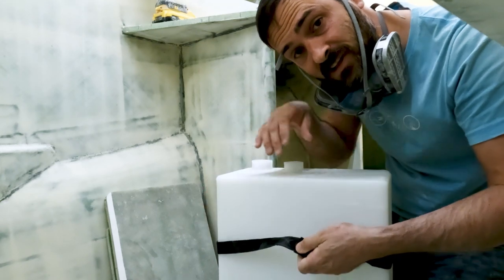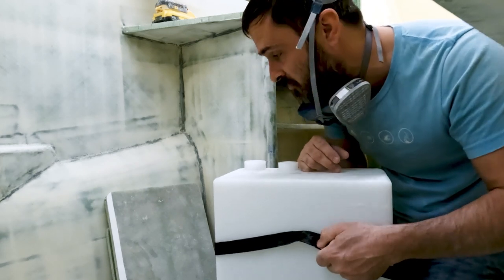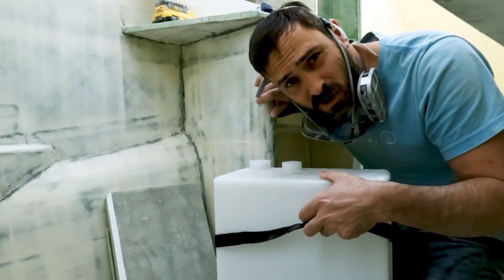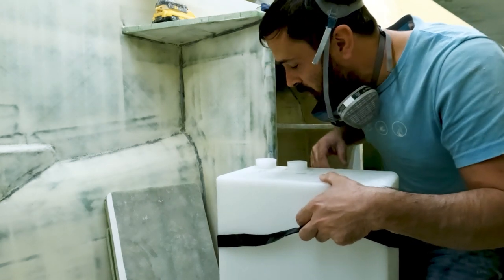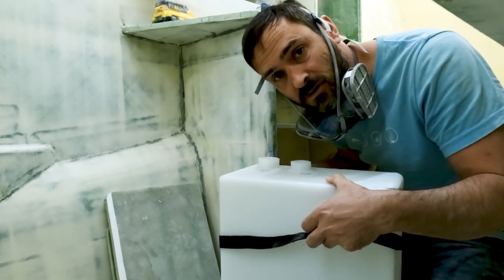Have two of these. The idea is that these will actually be glassed, fiberglassed in, because keep in mind this is all foam core composite construction. There really is no way to screw anything in. There's nothing really to screw to. It's just soft foam. So everything has to be bonded to it, glassed, or stuck to the surface or through bolted.